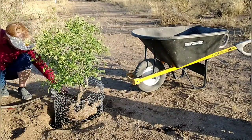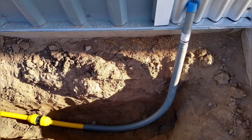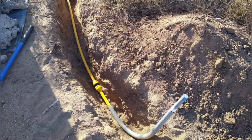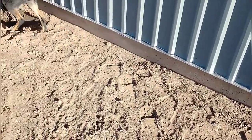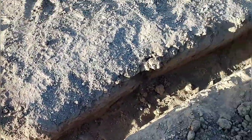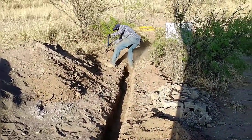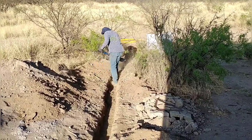Back to the trench — here you can see the risers for the gas line installed, with connectors joining the plastic line to those risers. The risers are pretty pricey. I've got the gas line buried all the way down, between eight inches and a foot deep, and on top of that I'm going to put the drain lines.